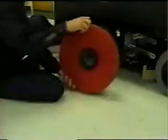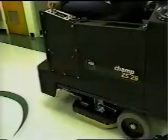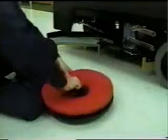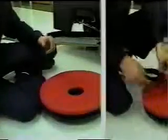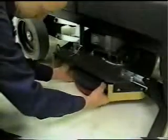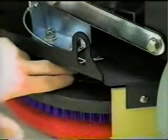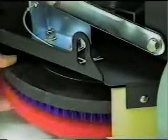The next step is installing the pads or brushes. First, make sure the machine is off and the brush deck is raised. Then remove the pin and open the side skirts. Remove the pad holding cup from the pad driver by lifting the tabs. Position the pad, then secure it by snapping the pad holding cup to the driver. Position the pad driver or brush lugs under the drive plate, lift the lugs through the openings in the drive plate, and turn the driver or brush toward the latch. Always be sure to close the locking latch around the lug, or the pad drivers or brushes could fly off the machine and cause injury.